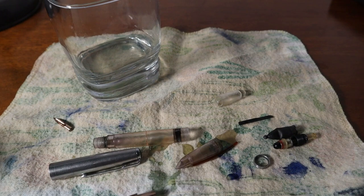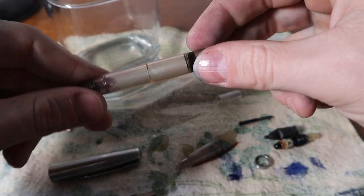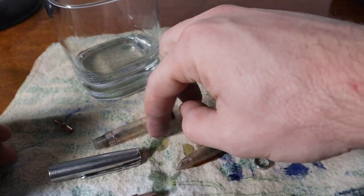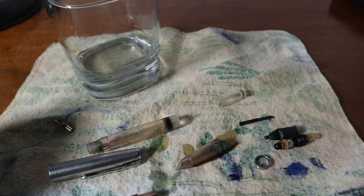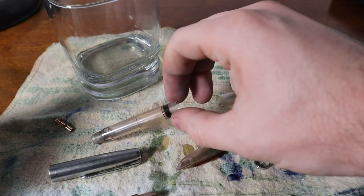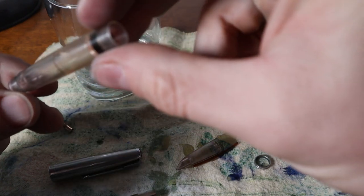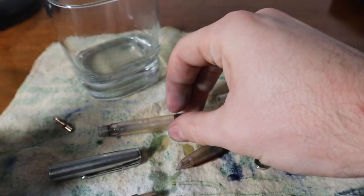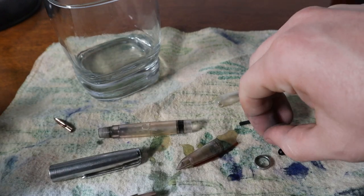But what I think I can do now is a lot of this cleaning. So there's going to be some soaking, some brushing, soaking, some brushing. I'll probably go back to some soapy ammonia to soften some of this gunk. And I will use my cut down toothbrush, my pipe cleaners on the insides and some Q-tips, really trying to get this stuff off. And then I will probably just use my polishes. I don't think there's anything too major on here. I want to see how my Novus plastic polishes work.